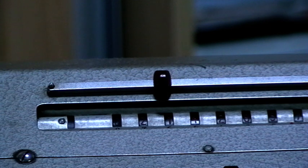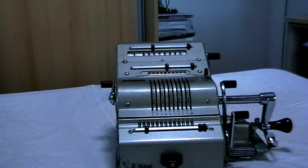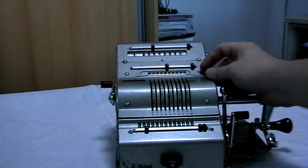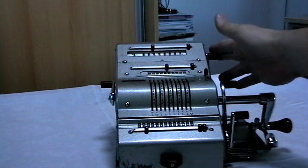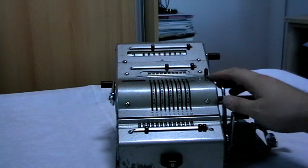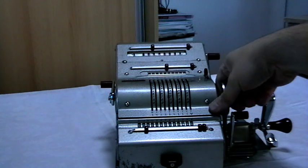And last but not least, all the levers here. I mentioned something called the back transfer mechanism. This lever sets the machine whether or not to also clear the input register when I pull the main lever for immediate division. I'll leave it to do that and pull this lever so it basically pulls the other levers and clears all of them at once.